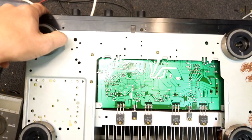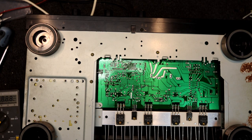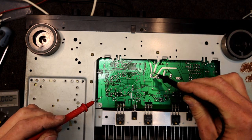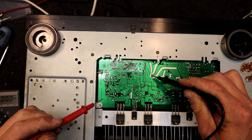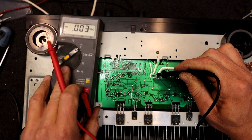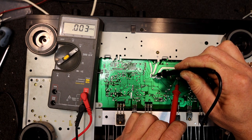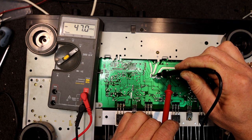I think this might have a bit more wrong with it than just being a bit crackly, or if it was crackly it's since blown something. The case should be earth. If I go to the big capacitor — we've got 46 volts on that cap, and we should have minus on this one — yeah, minus 47.